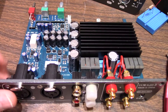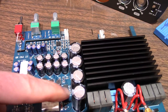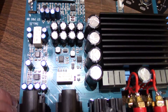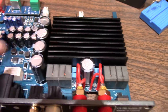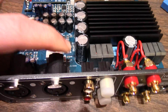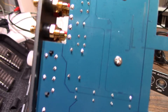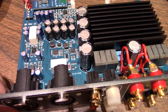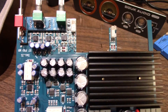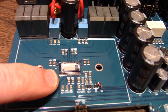Okay, this is the amplifier internals. Lots of NE5532 chips around. This seems to be a power supply developing the rails for those op-amp chips. These are the output inductors and filter caps. These are Rubycon — there are five of them, all across the supply rails. These blue ones are Elna caps. I don't really see any issues yet. I've got to look at what's going on under the heat sink though. Well, well, well — they did it right this time.